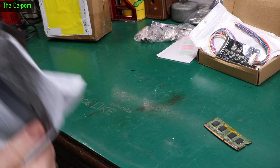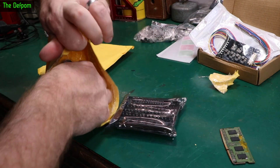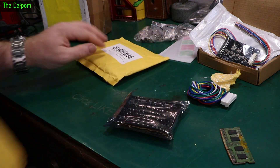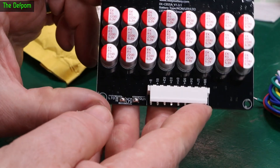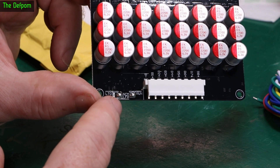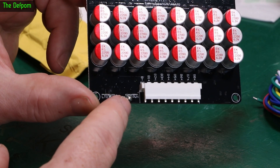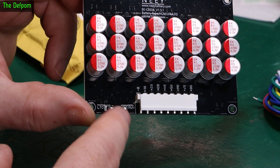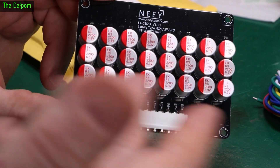Multiple packages in here. ADS 5A — both the same. So it's another balancer, but this one's an active balancer and you've got some options: NCM, LFP, or LTO. Obviously it's in the LFP option. And there's a run option there too, which basically means it's always on. If you want, you can break that connection and run it to a switch — when you turn the switch off, the balancer won't run, and when you turn it on, it will run.